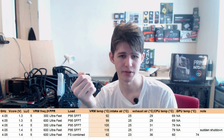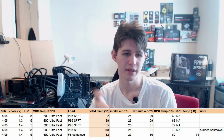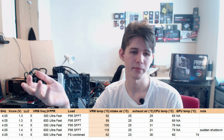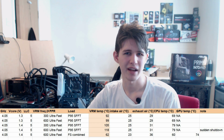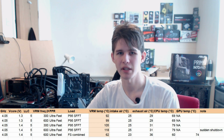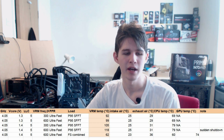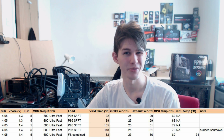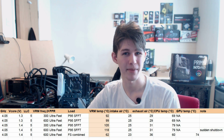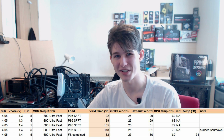Yeah, but here it was doing okay-ish, so 92. Then if you crank up the switching frequency of the VRM to 600 kilohertz, it was doing 99, which I'd still consider acceptable, because that wasn't the capacitors. 1.4 volts for a 2700X, I'm going to say, is not a voltage you would actually want to run daily. I would honestly max out around 1.35, 1.37-ish.